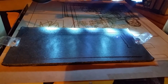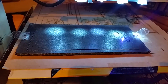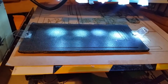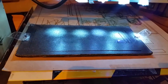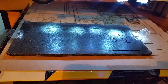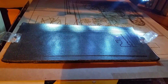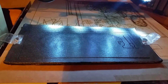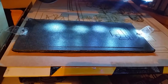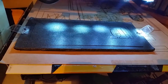It's making that exclamation point — it's pretty quick. With black foam you want to be careful about your feed rate. If you have a fixed beam strength laser — meaning no PWM controlling the power output — the only way to control how much laser energy is deposited into the surface is the speed, or how long it lingers over one spot. With a lower power laser going a bit slower to cut the foam, the problem is that foam is a great insulator so heat tends to linger, causing warping or bending, and it may even melt fine details due to heat build-up in a small space.